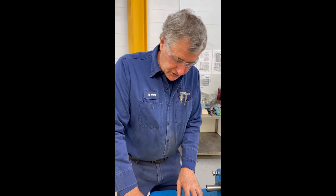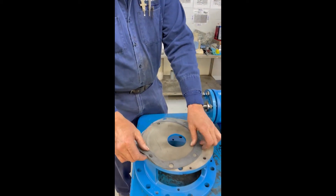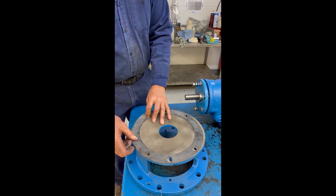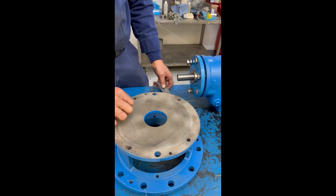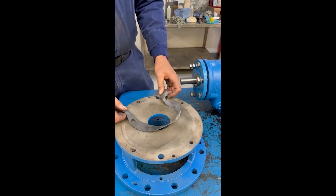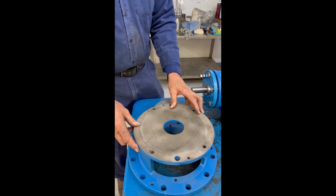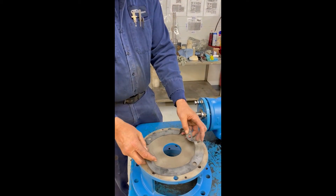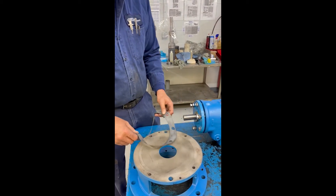The torque is very crucial, and it is only 20 pounds of torque. The gasket is just a thin rubber membrane that, without a proper torque, could easily come out of place and create a leak. If you over-torque it, there's a small raised ridge on the flange — that's really the sealing area. Over-torquing these bolts could cause distortion in the frame adapter itself, some pull on the bearing frame, or pinch and extrude this rubber seal. There again, you'd have a leak or an improper fit if you warped it.